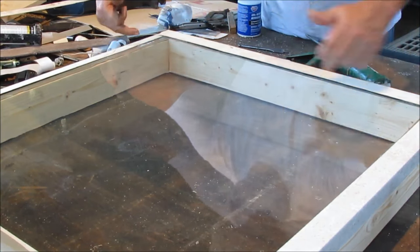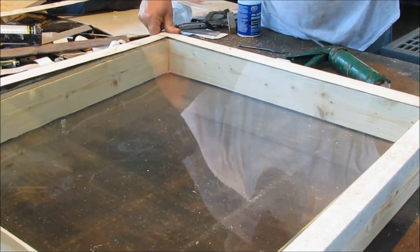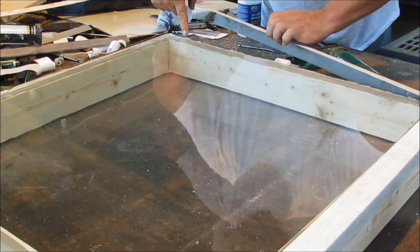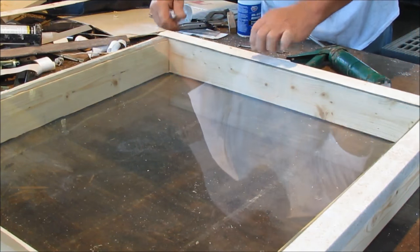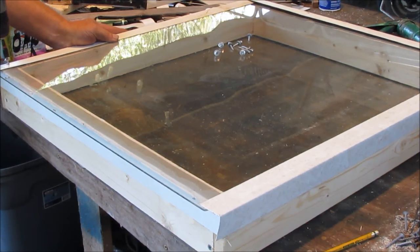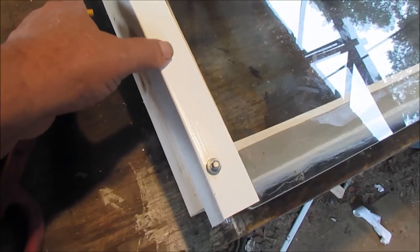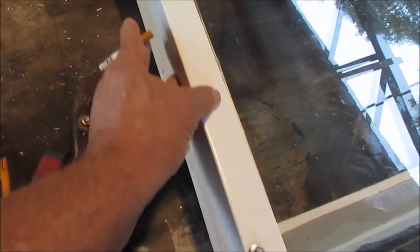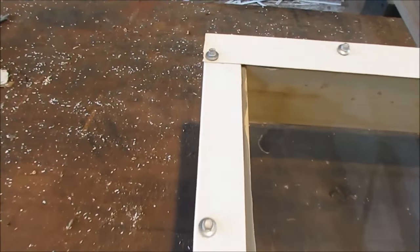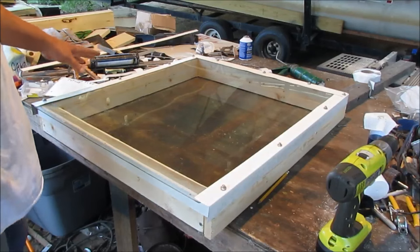But that ain't the end of this story. See, this piece — the two outsides go under, and this one goes on top. We've got a board here hanging over to screw the stuff down. Any roofer can flash the hell out of this. I never mentioned these side pieces of eave metal — that's what covers up the silicone. And then there's the top, and down here at the bottom I finished putting the screws in it.